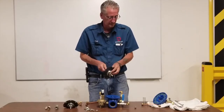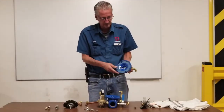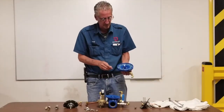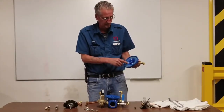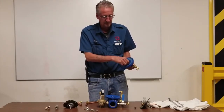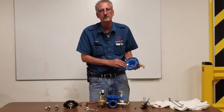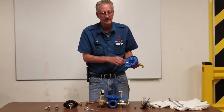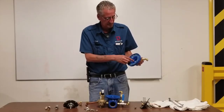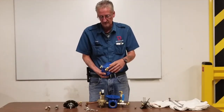This whole assembly comes as one kit. Take the top to the slop sink. Here where your fittings are is the common place for these to start plugging up with rust. You want to clean all this out — take a little Scotch-Brite or something, but not too aggressively, because these are epoxy-lined to help stop erosion. So you don't want to dig in here with a screwdriver and remove the epoxy. Just take something gentle, clean all that out, rinse everything out, and run water through here.